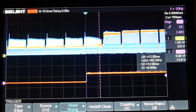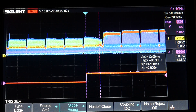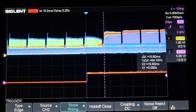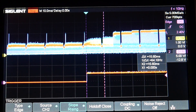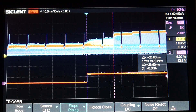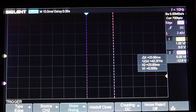What I want to do is let this run for a while. The board tends to heat up because it takes a lot of amperage, which turns into heat, and I want to see if the heat will actually increase the latency — that's going to be pretty interesting. Right now we got 15.6 milliseconds, and going through my mind I believe this is doing a lot better than the Caddx Turtle V2 in terms of latency. Here we got a pretty big one — 23.6 milliseconds, the largest latency we've gotten so far.